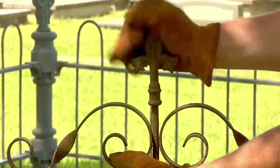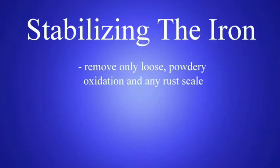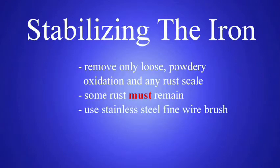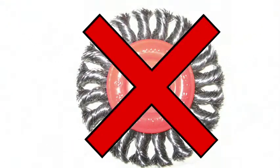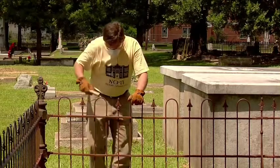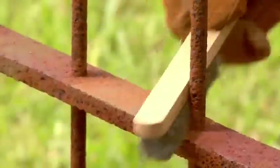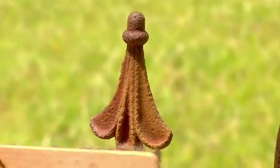Now that we have addressed all of our structural issues, let's work towards stabilizing the iron. We want to remove only the loose powdery oxidation and any rust scale that is on the surface. Keep in mind that we are going to treat this fence with a rust converter, so some rust must remain. To do this, we are going to use a stainless steel fine wire brush. Heavily corded or twisted wire brushes are too aggressive for historic ironwork and can easily remove too much material. When selecting a wire brush, you want to choose a finer wire. The fine wire lasts longer and is more flexible to reach tough spots and corners. I do not recommend sandblasting, since some of the fence's detail could be lost and the iron will get over-cleaned.